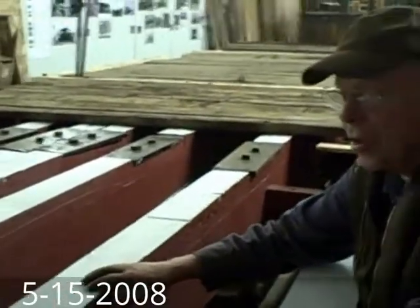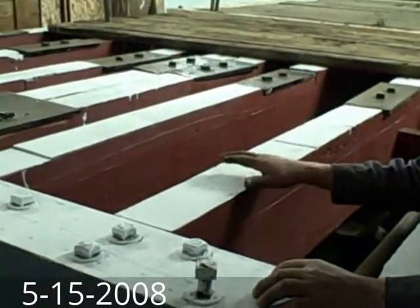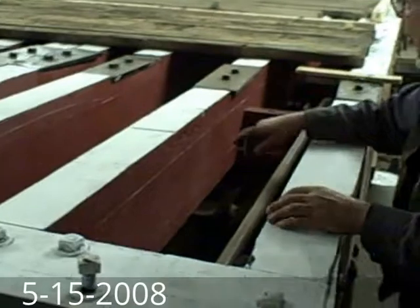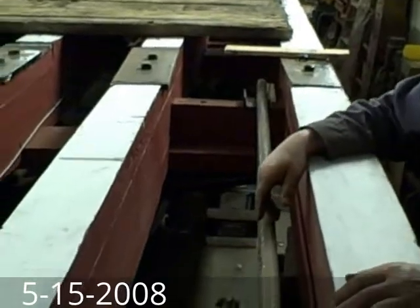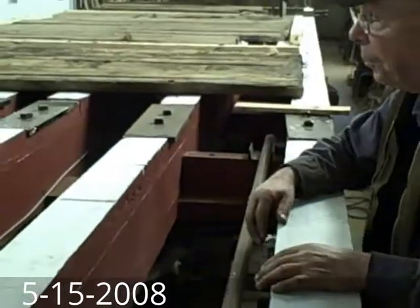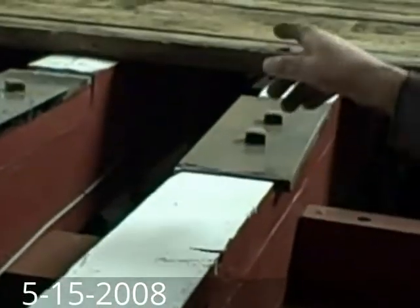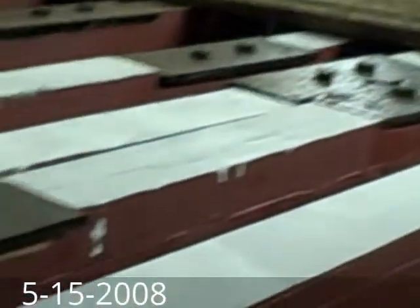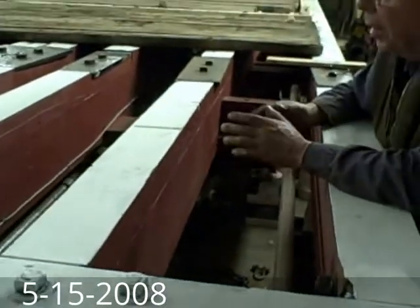The white you see is to replace what was on here and long gone. This is unleaded white lead, which was used as a sealer, and we put it on as carefully as they did originally. We found traces of it had run down — we didn't do it deliberately, but we see why they had that problem. That was a protective coat. We also checked and sealed up all the cracks and any holes that were in the original timbers. Most of these are a new top, so there wouldn't be any holes, but we patched and caulked all around wherever water could possibly go in, so we hope we'll be alright.